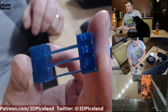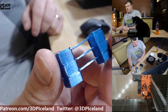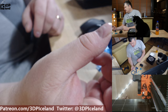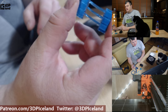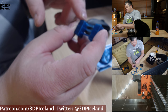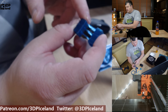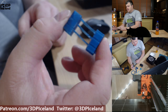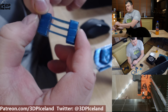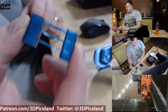I did a small temperature test and the bridging came out really well — very clean print. I did cancel the print partway through because the tower was going from 240 down to 200 degrees, well below the recommended temperature. At 235 degrees it came out really well, so I decided to stick with that temperature.